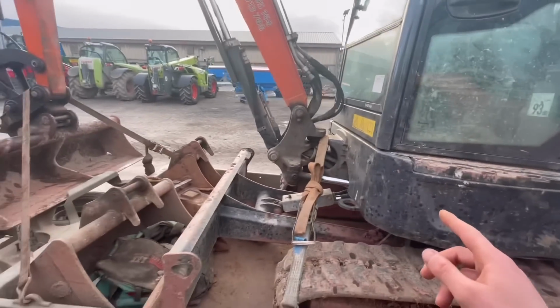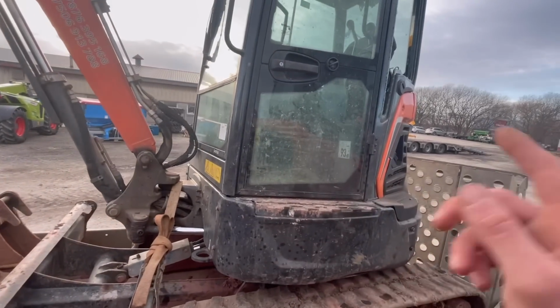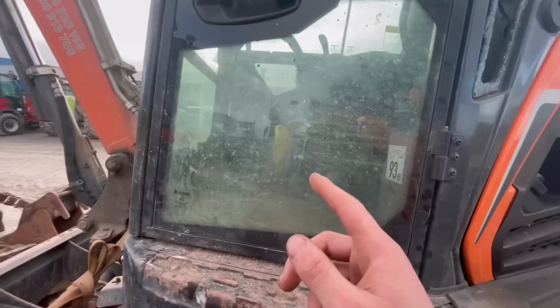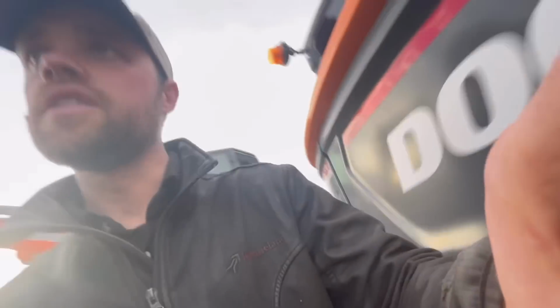So this finished its job. Remember I was at it last week, just went to it for the hitch not working, got the hitch going, and then noticed that the pilot cut off solenoid wasn't working, and also the fan has only got 1 speed, which is flat out. So I'm going to work on that tomorrow afternoon, hopefully.